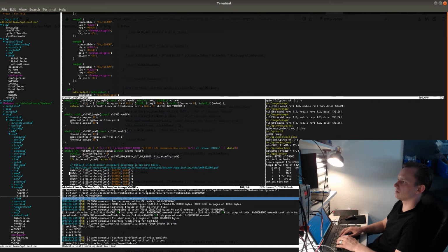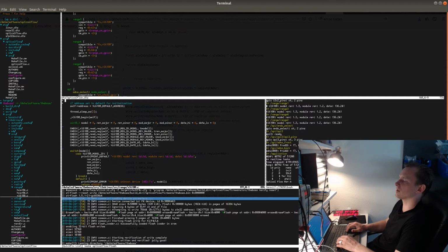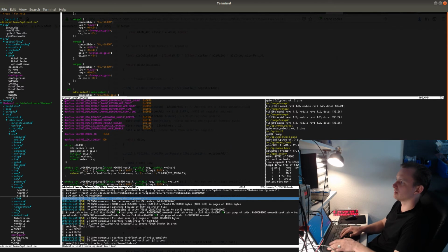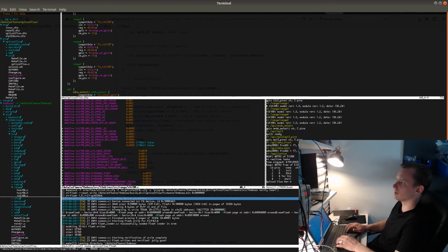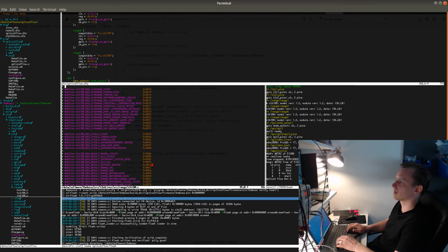Okay, so moving on to, I'm gonna add the read method here. I'm gonna make this driver export an analog interface for each instance of this driver. So it's gonna be like this. I will add an analog device here. And then we can have channel 1 as range and channel 2 as ambient light. Actually analog is already included, so I don't need to include it again.